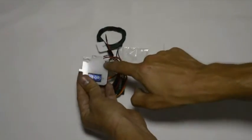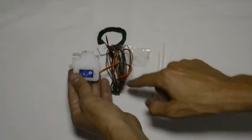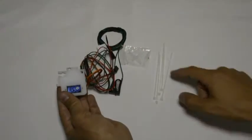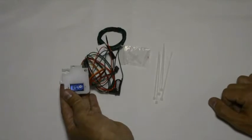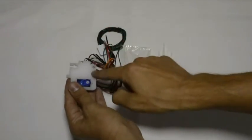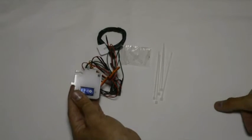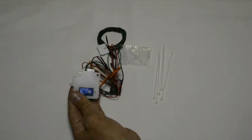You'll see there's a hole on the top right hand side of the perspex part. After we have mounted the arm to the servo with the last screw that's in the packet, we can tie the wires with one of the cable ties to that hole. The other cable ties are to fix the cable along the other cables on the way to the electronics.